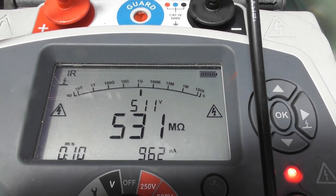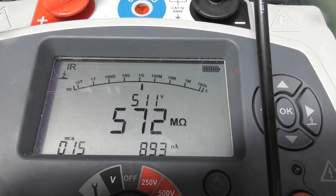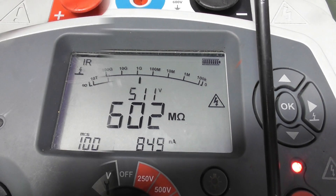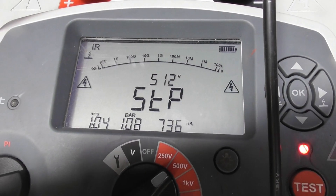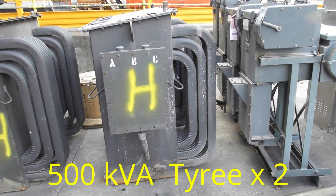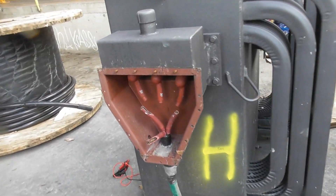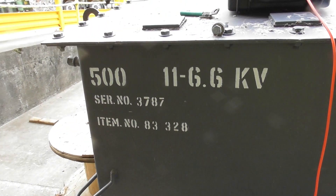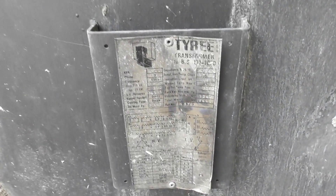You can see this is a bit lower reading than the other transformer, but still good — it's not too much lower actually. It's five to six hundred meg. We probably get out of this device 693 megohms — pretty good for its age and a couple of other 750s. And the insulation tests on this: 500 kVA, 11 kV / 6.6 kV on Tyree.